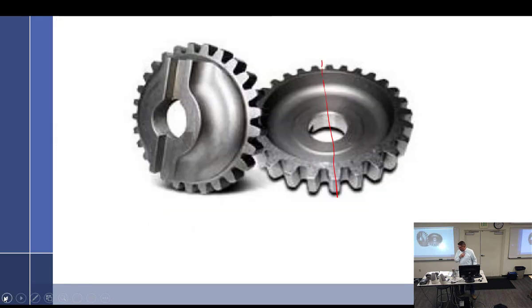All right, what else I got to say about magnetos? Ignition harness. Ignition harness, the number one cylinder is always marked in some fashion, especially with Slicks. They have a little number one on them. I appreciate those. They're the best. I don't think Bendix always does that, but all new harnesses down in the end, the nut, will have something on there where it'll say T1, B1, T2, B2. It's going to say something like that.